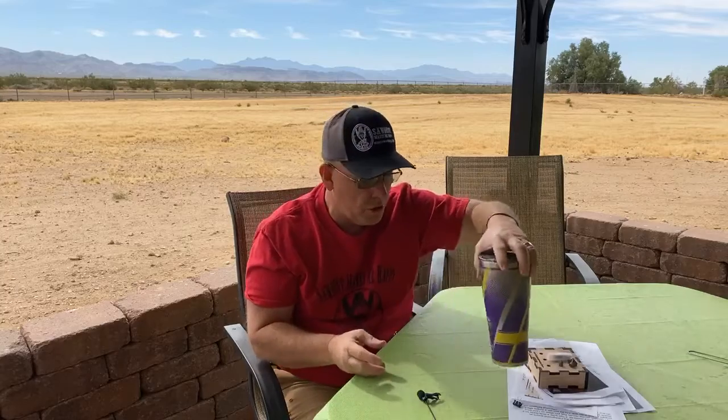Oh, Tessa said, what do you call the thing you put on the bottom of the router base to cut a board design like the camper, and what size? Okay, so talking about those. The template guide. It's either called a template guide or a guide bushing, and it goes on the bottom of your stock router base. It doesn't fit on our router bases because it has to have a machine step in there so that it fits flush on the bottom of the plate. But it's called either a template guide or a guide bushing that allows the spiral upcut bit to go down through it, and then a little step on there will follow the pattern for cutting your shapes. We've got tons of videos on that. If you need videos on it, anybody, then let me know for sure.